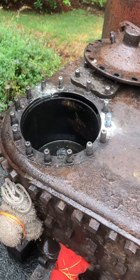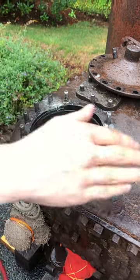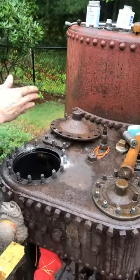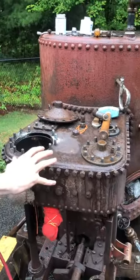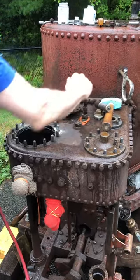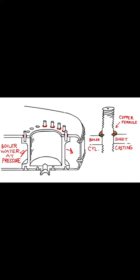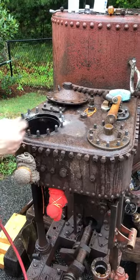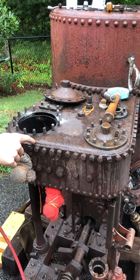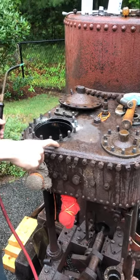What's going on here is Witt set these cylinder castings inside the boiler, so this thing here is a continuation of the boiler itself. The cylinders are always surrounded by water and steam — mostly water because the water level is about here — so the cylinders are always at boiler temperature no matter what. It's a neat innovation; he didn't come up with it of course, but he was one of the few people building engines this way in this era. This thing's from 1900.